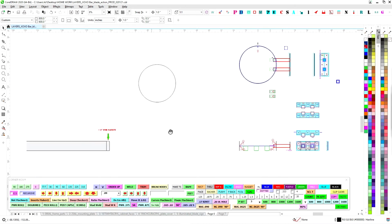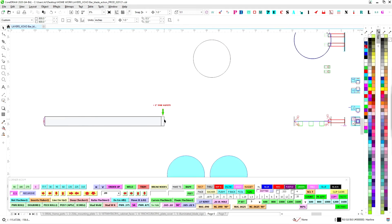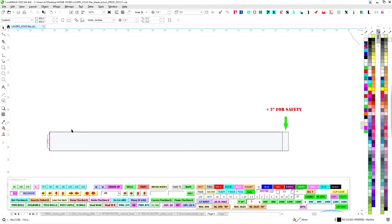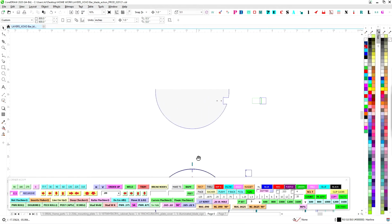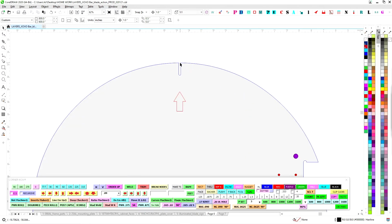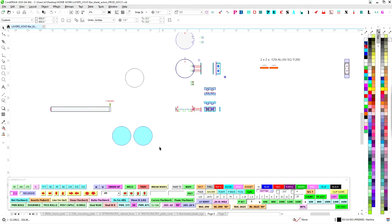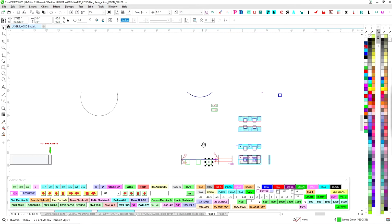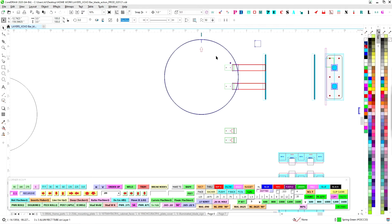So go ahead and throw this in the roller. Now that we got it all nice and set up, get that curved. You're going to go ahead and bend that 90, and that will slot in right up at the top there. Give you something to reference, and then just go ahead and work your way around. So just like you did on Cafe 111, I have this set up. The return is 6 plus 09, so that way you can take 3x3 blocks and go ahead and support it across like you've done on the other one there.